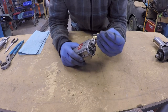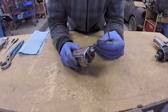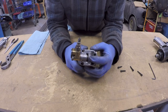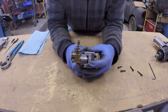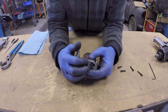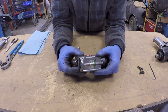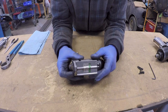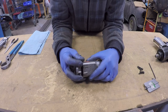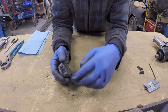We are accessing this motor by taking the back cap off instead of the front. The main reason why this tool comes apart differently is because the direction of the motor is controlled by airflow which travels through the back housing. When we pull this apart, we have the butterfly, which is the actual lever used to control the valves. We have the valves here and here.